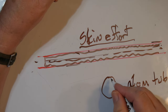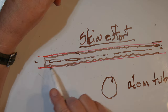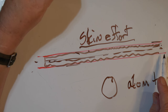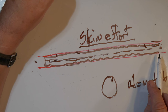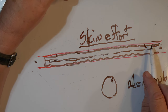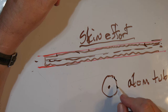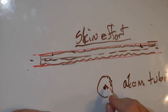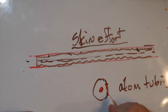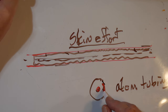The lower the frequency, the further current penetrates into the conductor. At HF frequencies, you're only getting a little conduction near the edge. As you go higher in frequency, the depth of penetration decreases, and the wire shows higher resistance because the skin depth is lower. This is also why on coax cables, current flows on the outside of the center conductor and on the inside of the shield. Higher frequencies mean shallower skin depth, which causes higher losses.